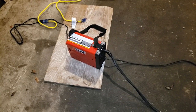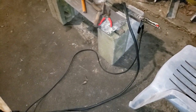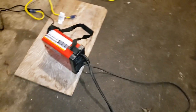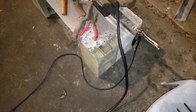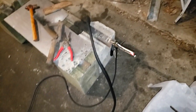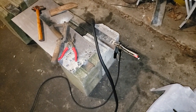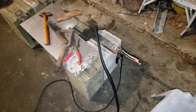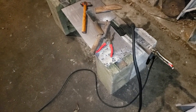Well folks, I thought I'd tell you where we ended up here tonight. Read the instructions on this little wire feed welder and got over here and started just learning how to use it. Found out that the very lowest setting on this thing is still too hot and it's blowing holes in the piece of metal that cousin wanted to use. It's a fine little welder, though, because we got over here on a thicker piece of steel, kept messing with it, and actually ran some fairly decent beads — flat beads across the steel with good penetration. I could tell by the heat on the back side. We're just going to quit for tonight and start over tomorrow with some thicker metal that I've got over at the house.